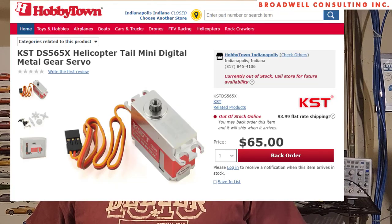These servos are a little bit different than your garden variety sort. First of all, they're very expensive — I bought one and it was like 65 bucks. Maybe buy a Serial Wombat chip or two if you use this pin mode to support me a little bit, because I actually don't need a servo like this, but you can't test it if you don't have one. Aside from being very expensive, they are very high-performance. Unlike your typical servos which get updated 50 times per second, these get updated 300 or 600 times per second. In order to do that, you can't fit a normal servo pulse width of half a millisecond to two and a half milliseconds into something you update 600 times per second, so the pulse widths are much narrower.